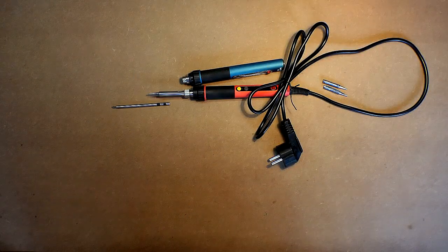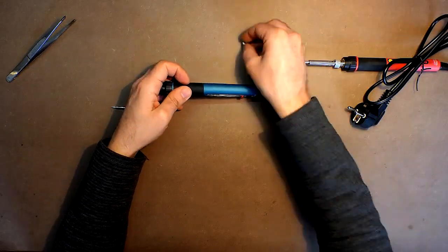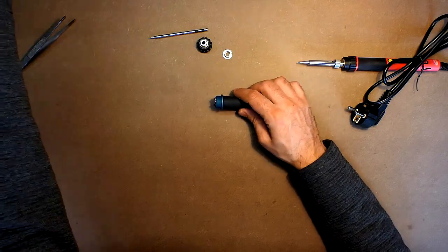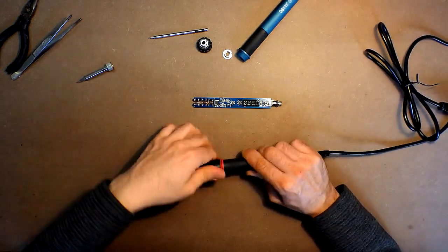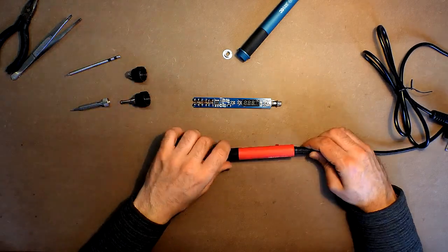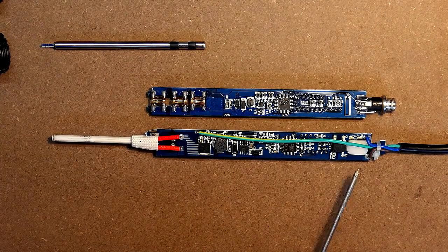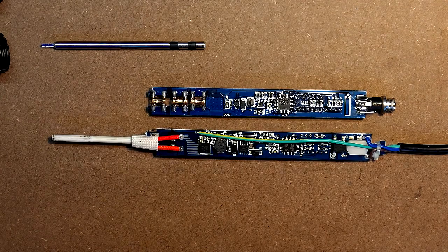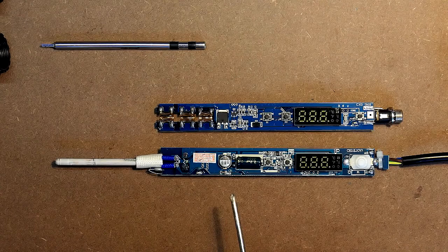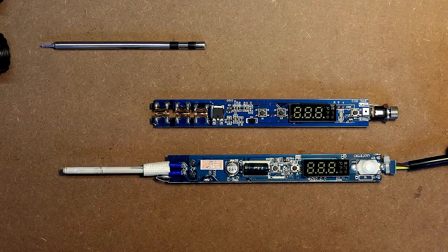First of all, let's disassemble these two devices. Here we have the rear side of the boards, and on the mains version we have a physical power knob, and on the portable version we should press it and hold for 2 seconds in order to turn the device on. And the front side. So if you try to operate the mains version on the modified sine wave inverter, exactly this capacitor will blow up. As to the quality, I really like the quality of CXG production. As to the package, the device comes in a small box.